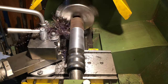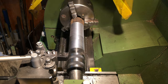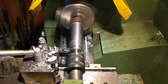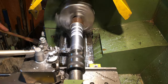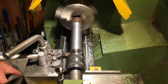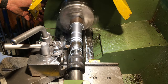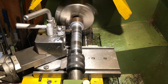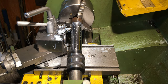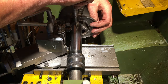The new insert allowed me to take two millimetres off the diameter at a time. The swarf was a bit stringy and when I put the rule up to check it had stopped cutting at the right place, the material was just a little bit warm — that prompted me to give the suds bottle something to do. I had to change tools because the back of the tool was going to hit the tailstock. I opted for a 12mm TCMG with a 1.2mm rad tip and took three equal cuts down to size. On the first cut I altered the speed to find the optimum for the best finish. The size I was after was just short of 1.25 inches to allow a little free play through the T-slot.